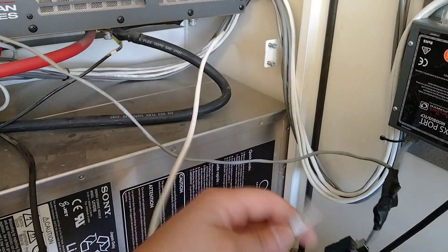Here, we're going to want to tell the inverter that for battery charging, we can use something greater than zero amps. So we scroll down there with the dial, hit enter once we get there, and it's going to highlight that field. We can increase it — I'm going to go ahead and start off with 10 amps. This is telling the inverter that it can use 10 amps for battery charging — 10 amps from the grid, so 10 amps AC. We're going to want to hit enter.